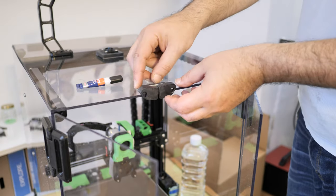I will test the enclosure with a model I've been wanting to print — a BB-8 case for the Google Home Mini. This is a complex model consisting of more than 20 parts with different geometries, making it a perfect test. All parts will be printed with very basic, cheap ABS at a layer height of 0.3mm for large parts and 0.2mm for smaller ones, at a maximum speed of 40 to 60mm per second. I will use rafts because dimensional accuracy is important and even small warping would require reprinting a part.